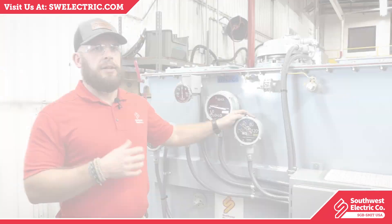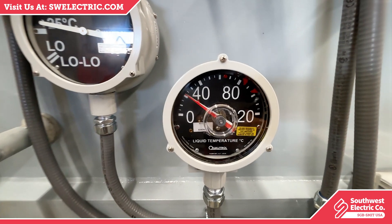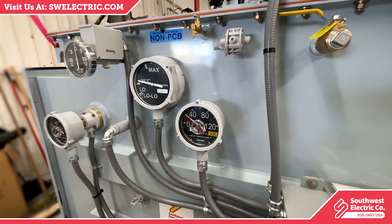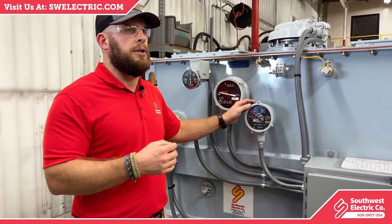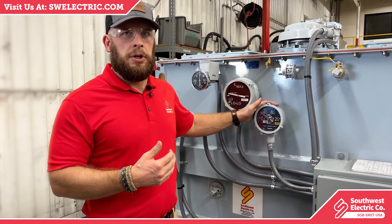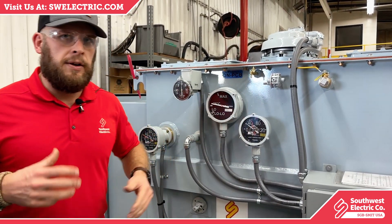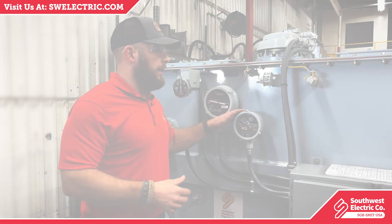Like the winding temperature gauge, this is also a temperature gauge, but it's specifically for the oil. While the winding temperature gauge measures the temperature of the windings, this one takes a reading of the oil temperature at or near the very top of the oil level. This is actually the more common gauge — if you get one temperature gauge, this is usually the one. Just like the winding temperature gauge, it has a max indicator showing the hottest temperature reached during operations, which is useful for both mechanical gauges and remote monitoring setups.